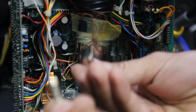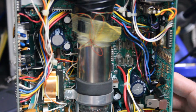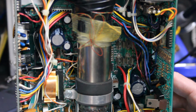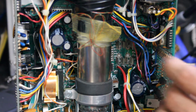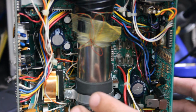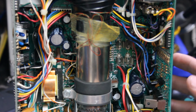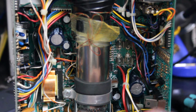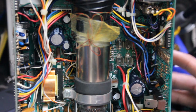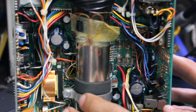but they definitely aren't right. Okay, so those fuses may have been good, and we may just have a no contact issue here that might be not letting power get through, but they're obviously not the stock fuses, and most people don't just go replacing fuses with the wrong fuses on a whim. So I really think there might have been a deeper issue in here that would have blown those fuses.